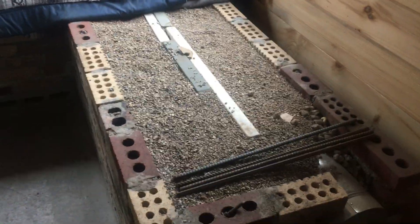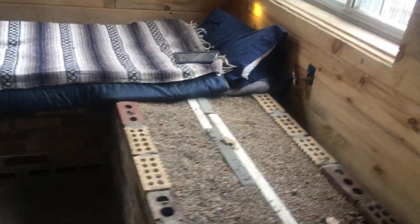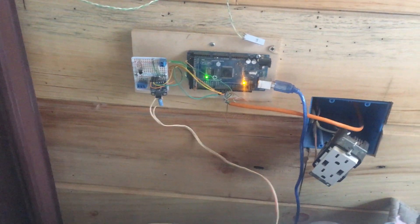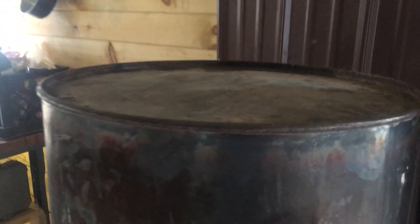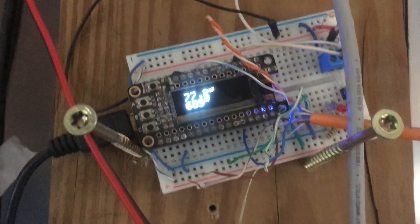It's exposed like this because I plan to add a two-inch thick concrete countertop which will cap it off, and I'll put some temperature sensors in there. Back here I've got an Arduino running, and that's hooked up to a high-temperature thermocouple sensor located at the top of the burn on the riser tube. That then sends the data over to another Arduino which displays the readout — very poorly on the phone here — but that goes up to the web so I can monitor what's going on with the heat.